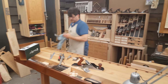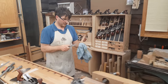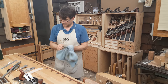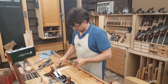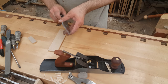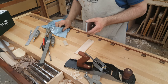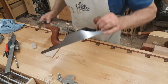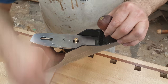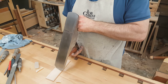I've got a big thick piece of Eastern Maple in there, end grain facing up. I've cut a chamfer on the backside in preparation for this so that I don't blow fibers out on that back edge. Wipe off all the moisture. Put the chip breaker on. I don't worry too much about how close it is — I'm probably somewhere around a 32nd of an inch from the edge. Snug that up. Get that water off my bench. Make sure there's no debris between the back of the blade and the face of the frog. Put that in.